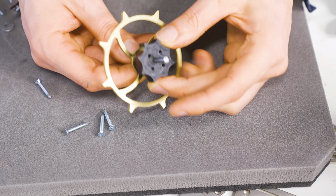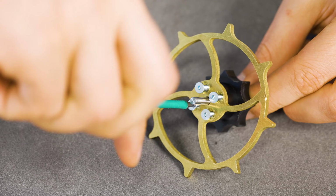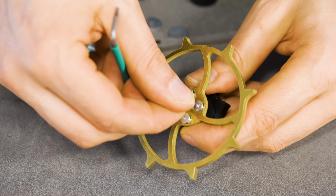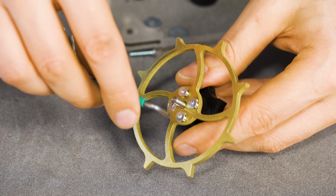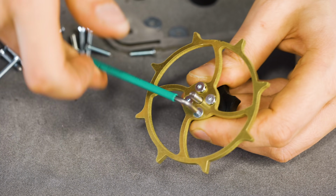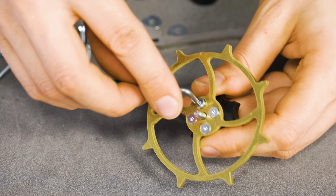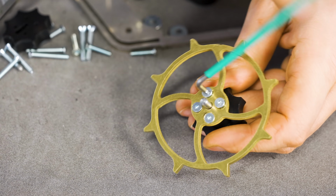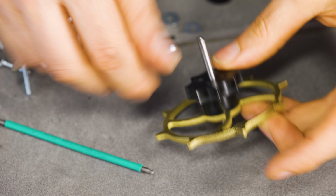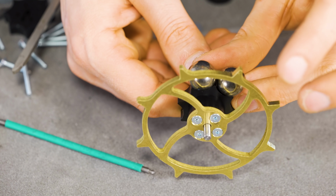I have noticed that whenever I use a machine screw like this and thread it straight into another material than metal, like wood or plastic, people get a little bit nervous about the hold strength of these screws, but I can reassure you that this works brilliantly. I feel the resistance here, and just because this is not how things are done conventionally, doesn't mean we can't trust it. I've designed these spokes to be right at a peak of this wheel, so we have 2 marbles in the openings, so kind of like this.